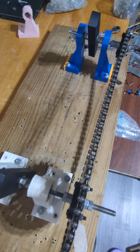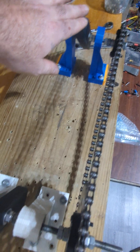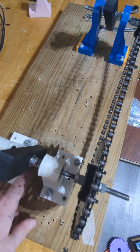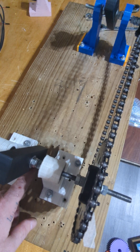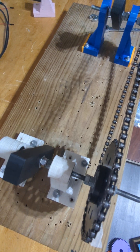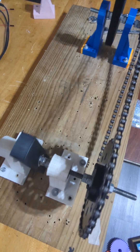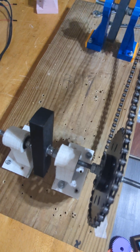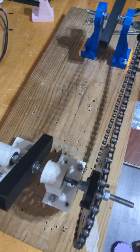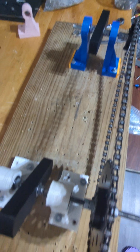When one leaves quicker than the other — you see that one leaves the coil quicker than the other — it went from zero to magnetic strength on this side. So it sees a growing magnetic field while this magnet is exiting the coil, which is the exact opposite of a regular generator. Normally it sees a growing field on the incoming; here it sees a growing field on the exit. Now it's going to attract this one back in, like regular Lenz's law — that's my prediction — but on this one it's going to propel it out.